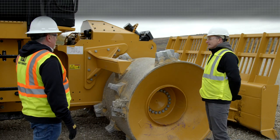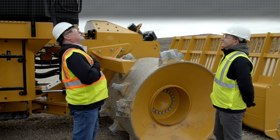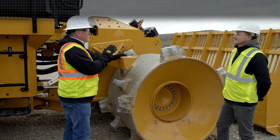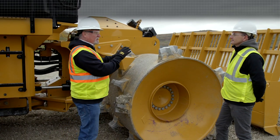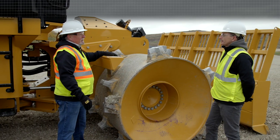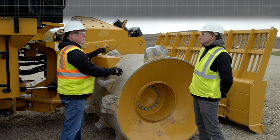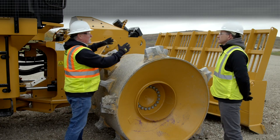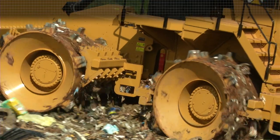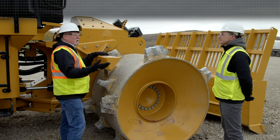On our machines, we strategically locate the tips on the wheel to keep a wide open space while still having as much tractive capability as possible. The big opening, the weight of the material, the mass, centrifugal force, and vibration will clean the tips out and clean the wheels, because we don't have any pinch points. However, if you get into mud, clay, or gumbo-type material — anything that sticks to Teflon will also stick to steel — then that doesn't work. So what we offer out of the factory is what we call our cleaner fingers. They're bolt-on fingers that come into the wheel and pry out the sticky material, so you still have all your tractive effort and your surface exposed on the tips.